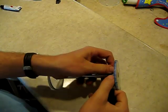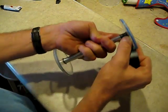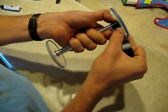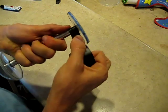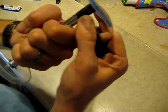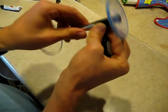You could use cotton or masking tape. My idea in using black electrical tape is that it will let the electromagnetic field be even closer to the soft iron. It's really important that you get right up into the edges on every layer because that iron wire will always want to sneak over there and rest on top of the soft iron and can short it out.